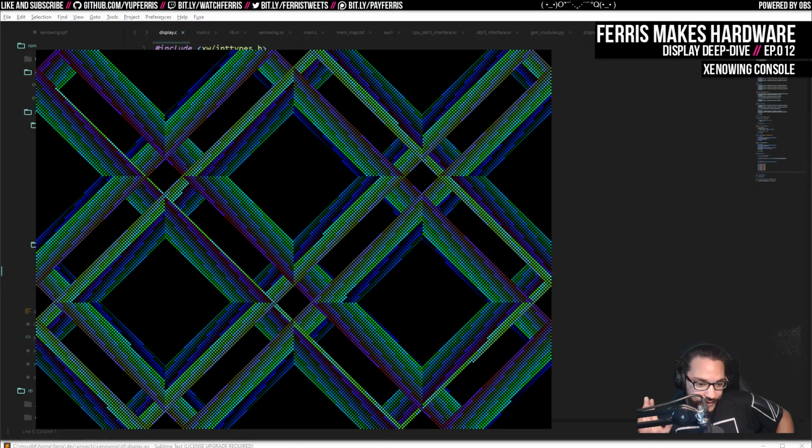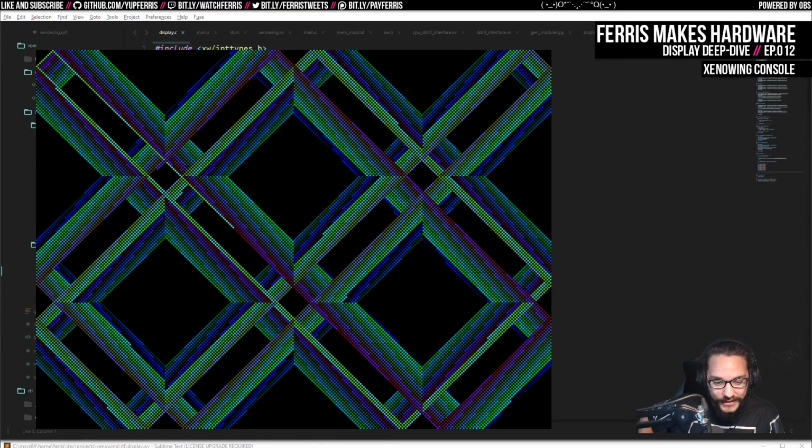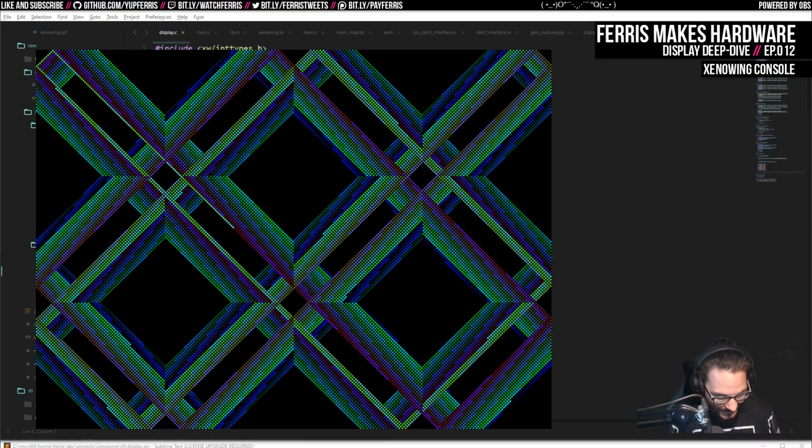Then we end up spending about 15% of the frame reading out data. And I thought, well, okay, at least that's acceptable, and it gets us to the right kind of resolution that we want for this system. So I was pretty happy with that. That's actually what I implemented. And that's why it ended up being kind of complicated, because I was really trying to reduce the amount of bandwidth we waste just pulling pixels out of the frame buffer. So with that in mind, it was kind of complicated how all this works.